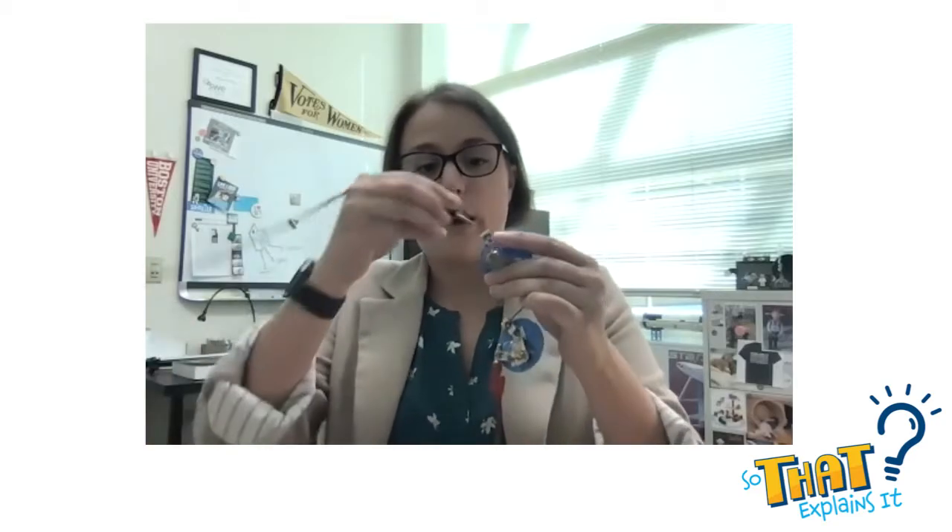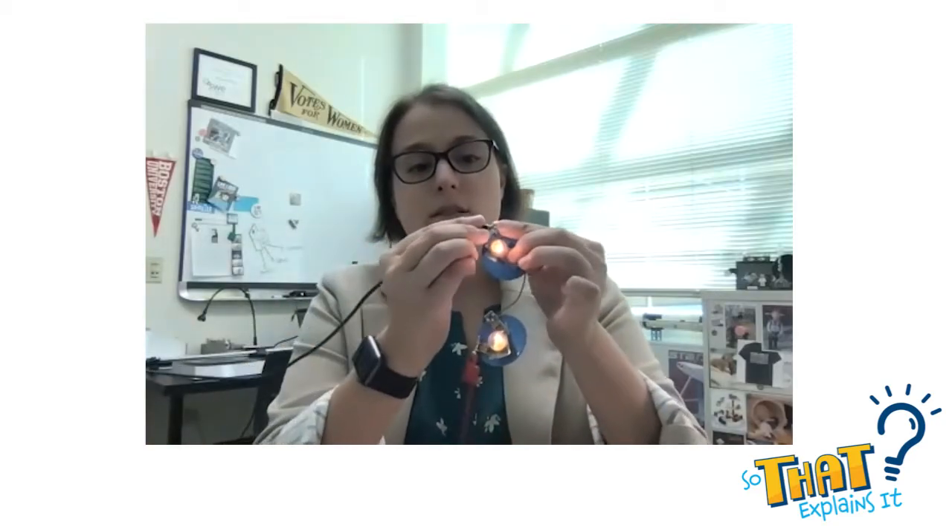So I actually have a very simple series circuit here. I have a battery connected, and it goes through these two light bulbs through this wire and goes to the second light bulb. So there's essentially one path here for electrons to take that goes from the battery through the light bulbs and back to the battery again. So if I take one of the light bulbs out, I'm essentially breaking that path for electrons to flow and they can't go anymore.